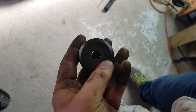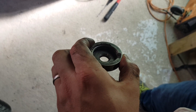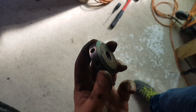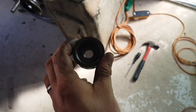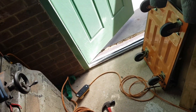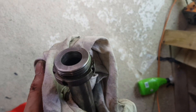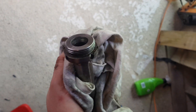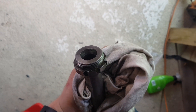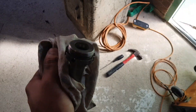One of the things I might do is end up making a new nose piece anyway to suit the new collets. I'll probably leave the old one as it is and make a new one with the right taper on the inside to fit the new collets. I think a little regrind would work well there - we'll have a look.